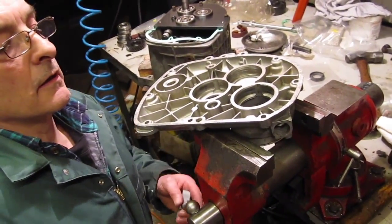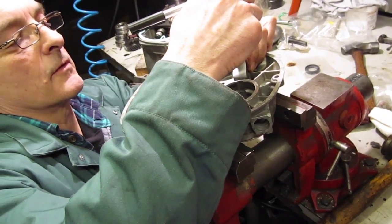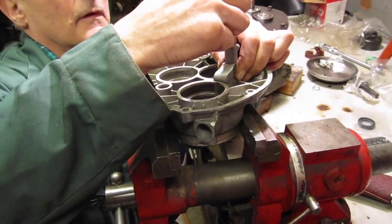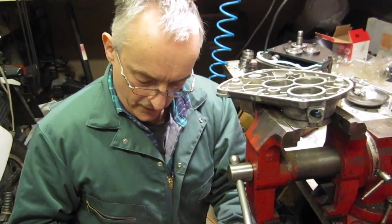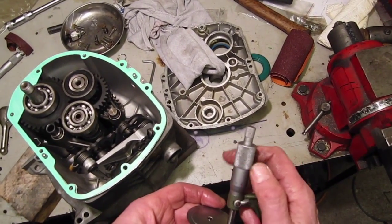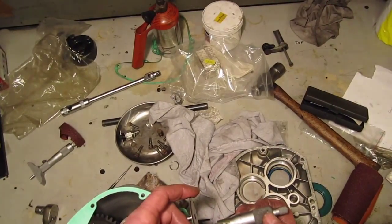The countershaft is this one. These are usually always that little bit deeper than the other two, because you've got to take into consideration a bearing shield at each end of the shaft — this end of the shaft anyway. Here we're getting a reading of 15.73 millimeters. We've got to measure the thickness of this bearing shield and enter that into the equation, and that is 1.03 millimeters.